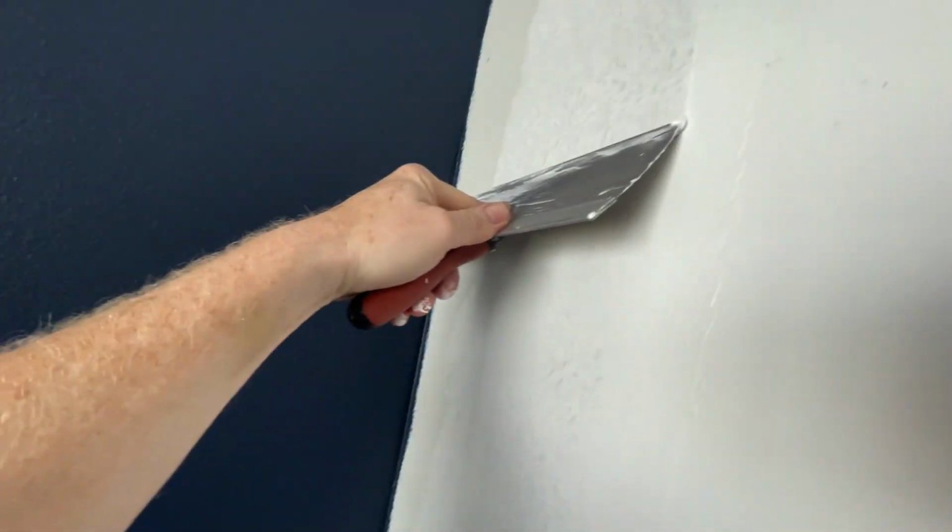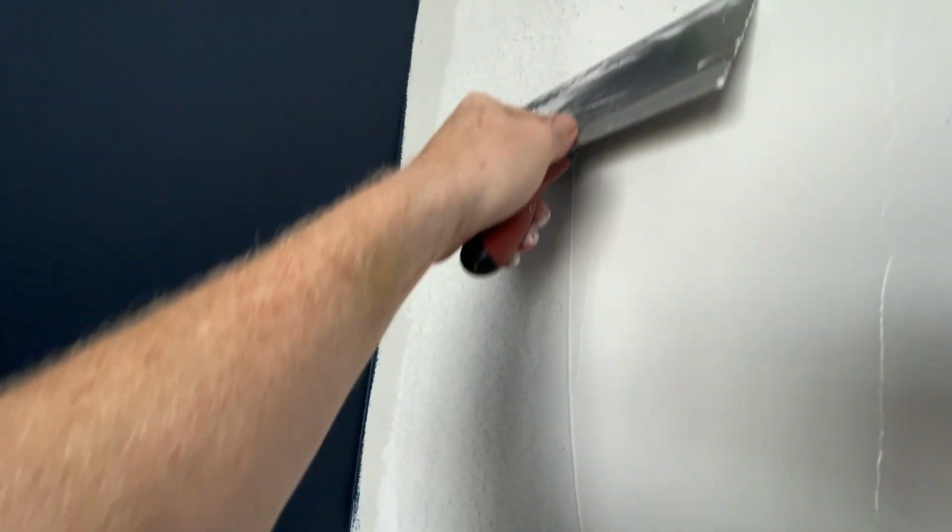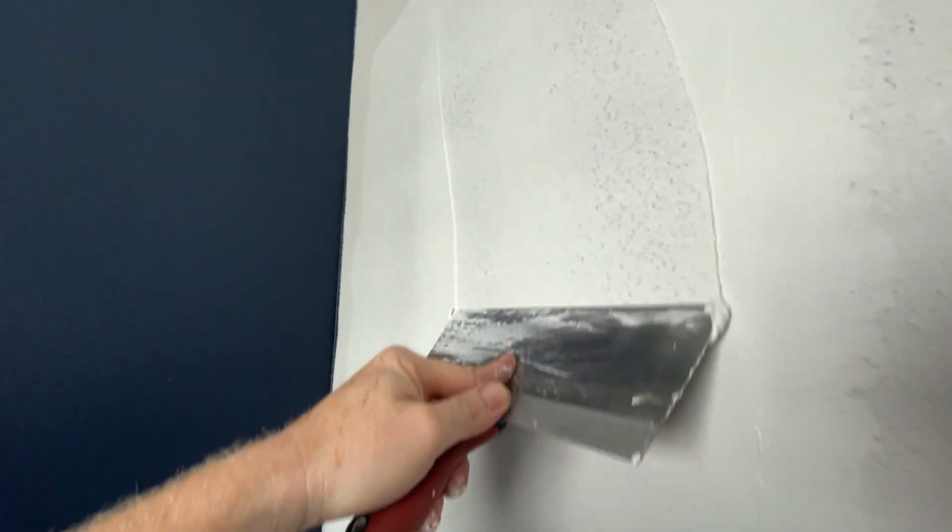Okay, no problem. Spencer, you're making lines. Yeah, for you, not for me. I'm making lines to prove a point. You're too thick here. You want dust all over your house? You want to have to sand this? No. This is what you do. Remember the angle. Pressure. That's what you want to see when you're done. That's right. Let's do it again. I'm overlapping, getting rid of the line I made. That's what you want to see. Remember the angle.